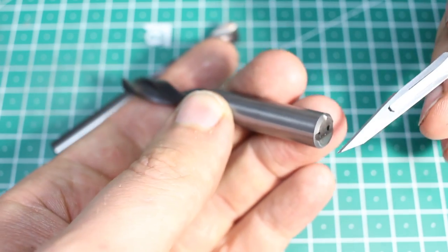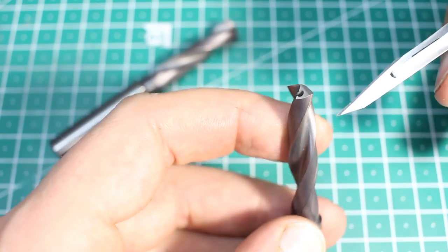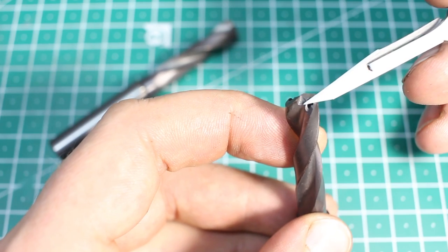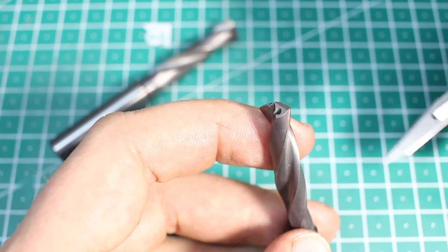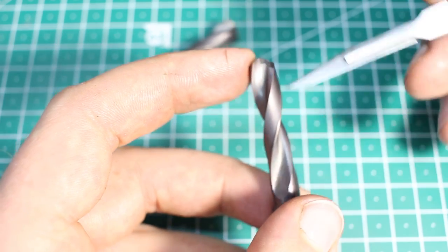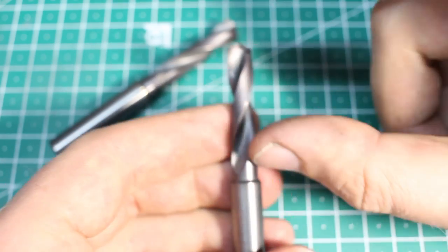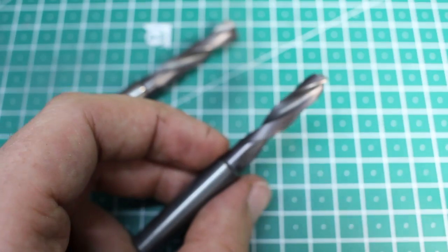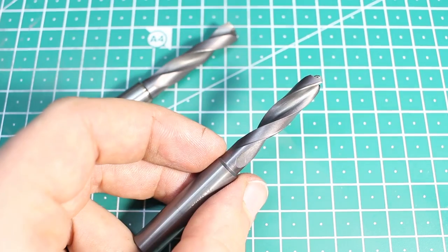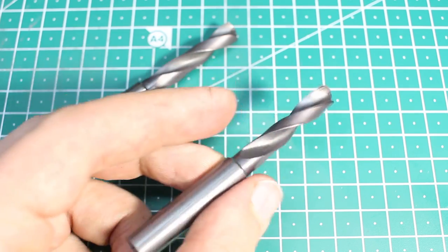And if you have a milling machine or a CNC mill with through spindle coolant, you can shoot high pressure coolant through the drill out here. This helps cooling the cut, and most of it is washing out the chips through the flute strip back. If you run a through coolant machine, you can drill with these usually three times or five times in one step, and do not have to peck drill or something like that. They're pretty cool. I obviously don't have a through coolant machine, but they're still useful for me because they are carbide.